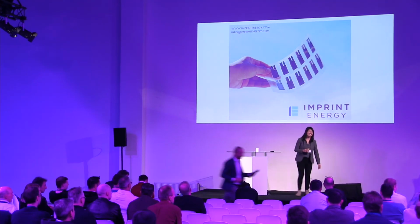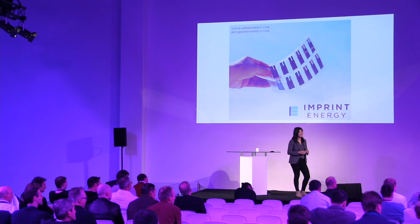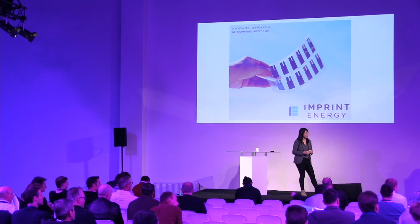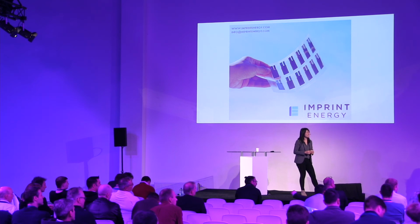Okay. Check the box, Christine. Very good. Another question, all the way on the other side. Hi. What is the temperature operation range of your battery? Yeah. So we've tested at this point down to I think -30°C and up to about 65°C. There are impacts. Batteries of all sorts are impacted by temperature. So in colder temperatures, internal resistance goes up. At higher temperatures, internal resistance goes down. So it's balancing that impact with your application. Okay, thanks. Do you have an application with very low or high temperatures? Yeah, I have an application with low temperature and a high. Then it makes sense to ask that. Yeah, very good.